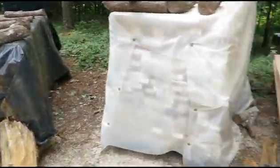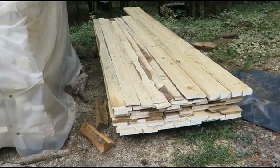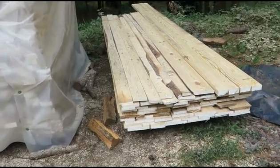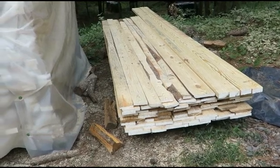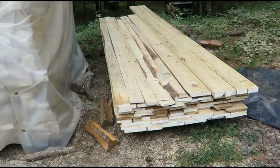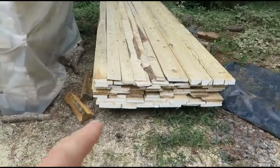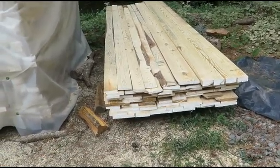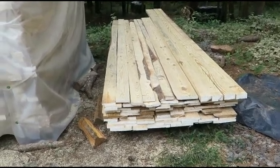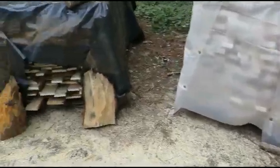And so what I'm going to use the 12-foot stuff for, and I've got more than enough there, is to do the second floor of the outbuilding. I'll eventually put probably a 5/16 plywood over it and just nail it down to get a nice smooth finish, but even that's going to be cheaper than buying 3/4 inch stock. At 3/4 inch, there's roughly 10 lifts or 10 rows, 12 feet long. So that is about the same as 13 to 15 sheets of 3/4 inch plywood, which is running between $40 and $50 a sheet. So I got that all done.